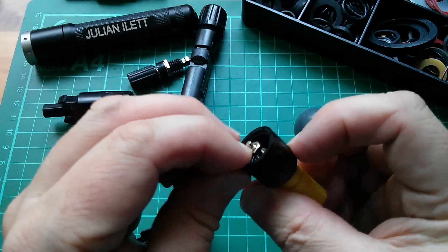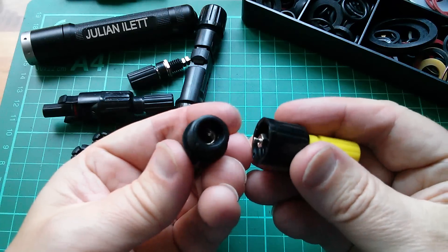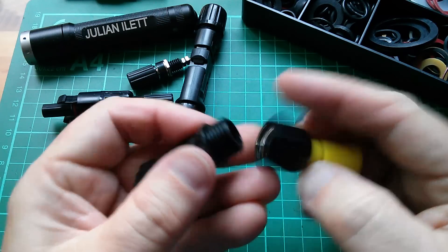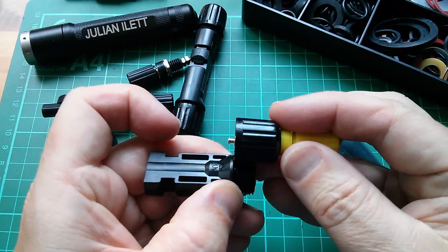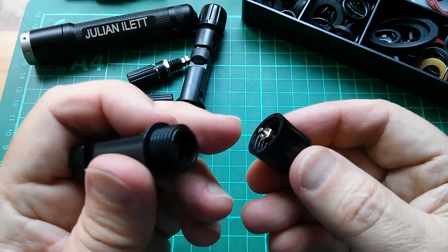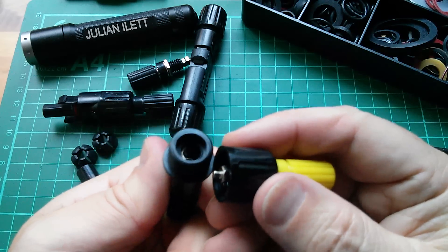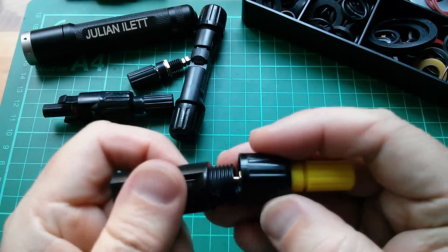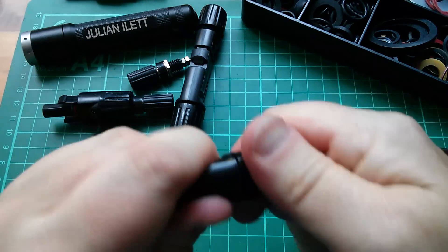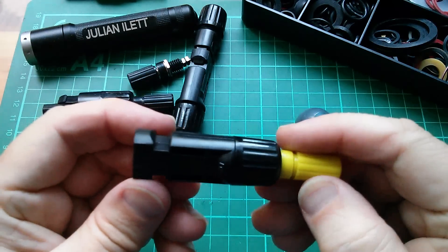Then it's just a case of positioning that near the end of the thread and tightening the two halves. What happens is the coarse thread of the plastic means these two pieces move together quickly, while the fine thread of the nut on the metal means that the nut recedes slowly. So there's a net movement inwards and the nut will push in against that metal wing. And if I just tighten that up — that's my new connector. Excellent.